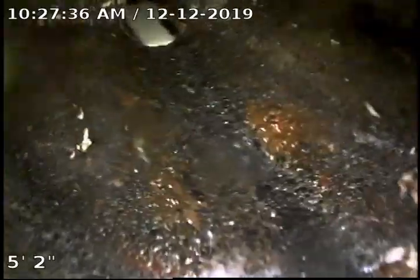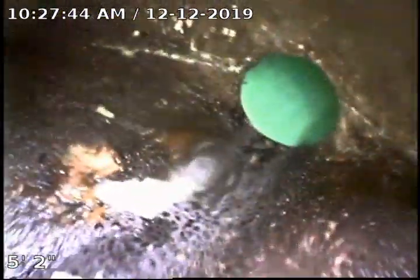As you can see, there are multiple units tying into this manhole — 3404, 3408, and 3412 are all tying in right here. At this point they lead to the 6 inch 3034 that leads out towards the street. That concludes the sewer scope. Thank you.